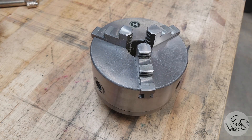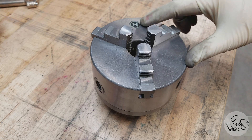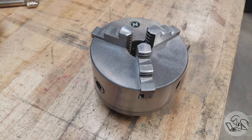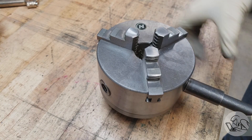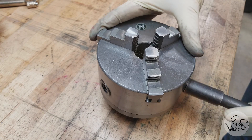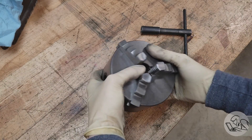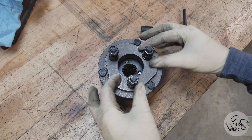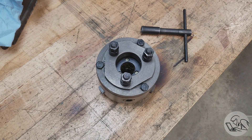Here's my three-jaw chuck. It's very standard as import chucks go on discount lathes, and as you can see it's the prestigious H brand, not to be confused with the A through G which are garbage. Now this lathe is getting pretty crunchy. I suppose you can't feel that, but hold some Lego bricks in your hand and roll them around and you'll get the idea. To fix this it's time to dismantle it, and luckily all of these import chucks pretty much come apart the same way.